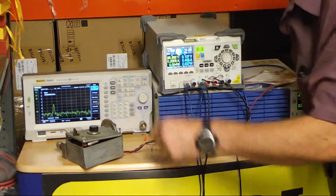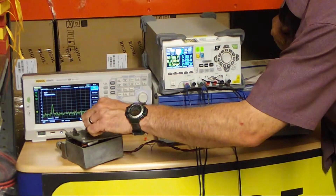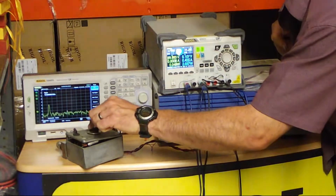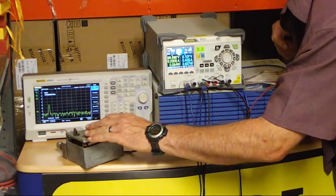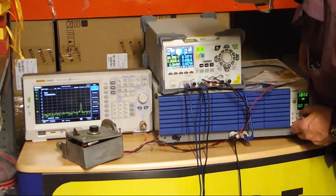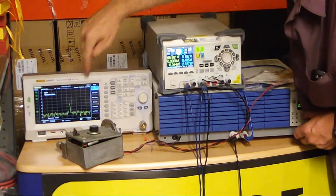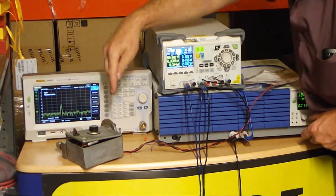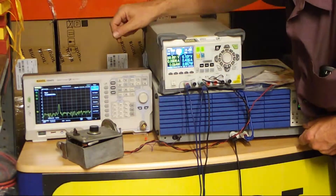It's moving — can you see the peak is moving? I'm going to try and adjust it. Look at that — I'm adjusting the bias voltage here. I've pushed that up to 300 volts. So it's very dependent on the voltages on the electrodes on the klystron.